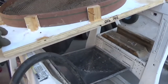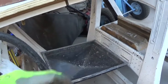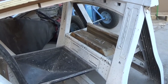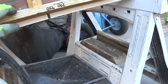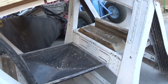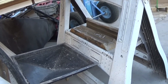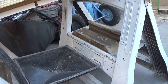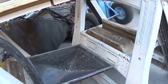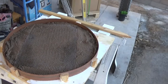Also, after I get this done, I'm going to take a rubber hammer, mallet. I'm going to tap it underneath, and also a vibrator. I just use a little palm sander. It helps get all the little air bubbles out of here. So it's not a big deal on a stepping stone because, you know, it's not really finished concrete. If it has a little bit of air bubbles or divots in it, it's going to look fine. So whatever you want to do, it's going to work out pretty good. And that's pretty much it. I'll show you the part where I take it out of the mold.